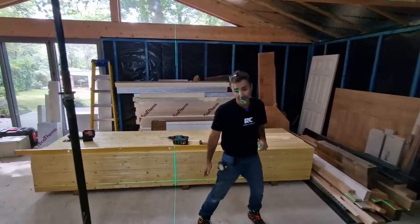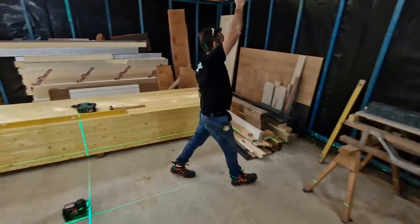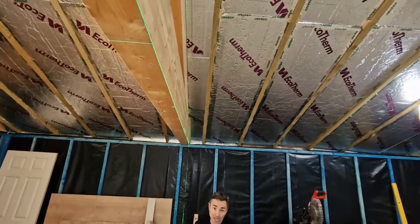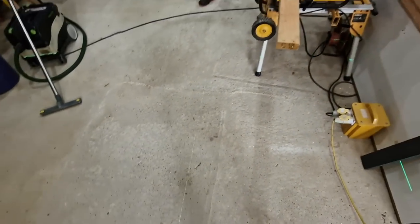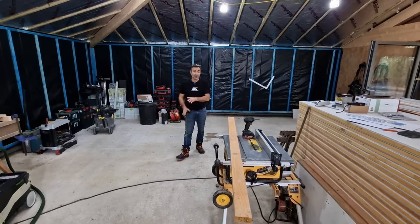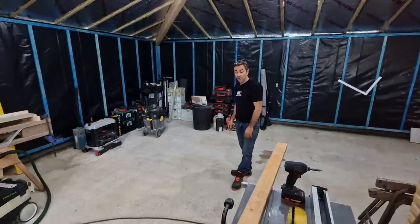We're using a quite sophisticated self-levelling laser which gives us a grid. We've got one of the axes trained on the edge of the glulam — that's our start point, our datum. We then have a line projecting all the way down at 90 degrees, and I've checked it off our external wall and it's exactly parallel. So I know that is true and exactly where I want it. I'm going to pin chalk lines over them and then get the sole plates built and fitted in those positions.